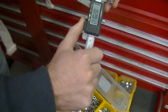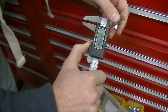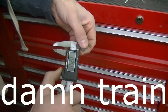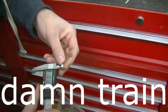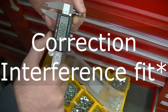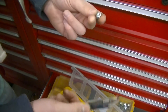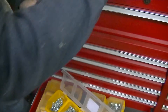Just so there's a little bit of play. It doesn't look like... oh yeah, these ain't gonna fit — that's gonna be a press fit. That's way too big, that'll just slide right on. My brain isn't working right now. Yeah, that's gonna be a press fit. See, if the minor diameter of a thread fastener is bigger than the nut minor diameter internal thread, it just won't work. It'll bind.